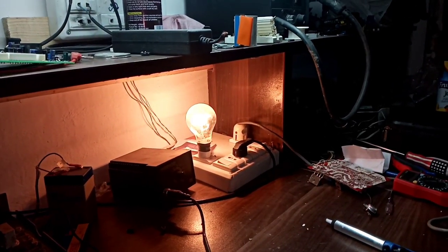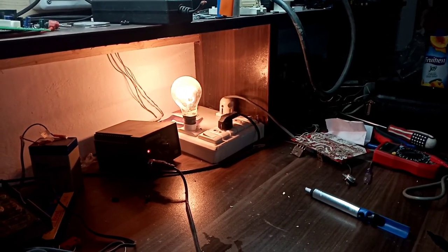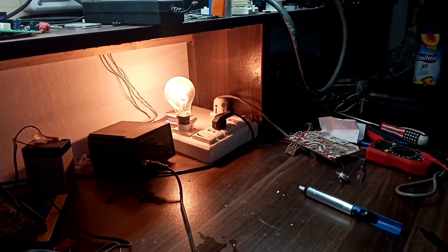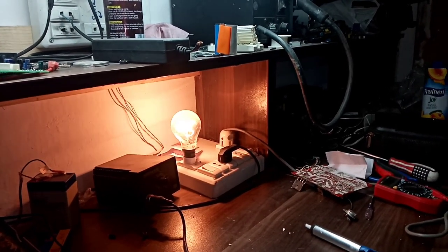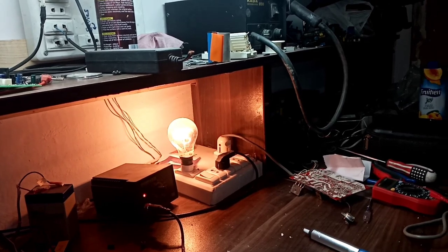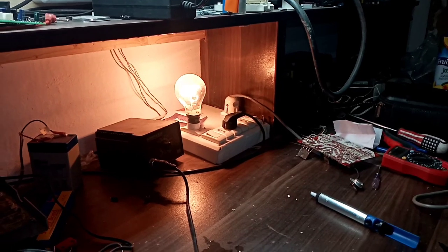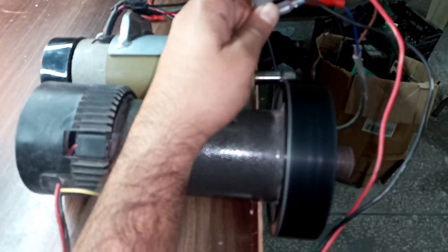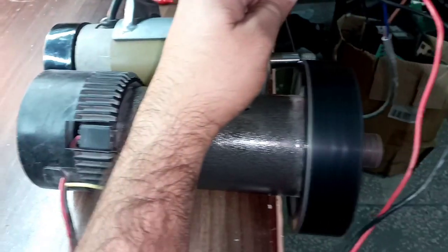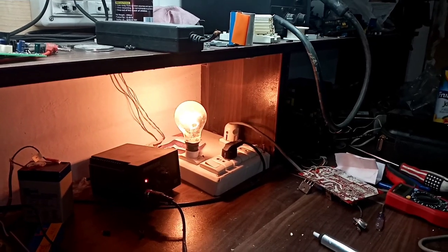Since this bulb is connected with this motor in a series circuit, it can draw only the power of that bulb. This bulb is 200 watts, so this motor cannot draw more than 200 watts. This is the behavior of a good motor — the RPMs are very good, the sound is fine, and the glow is almost fully reduced.